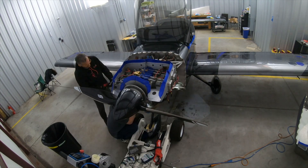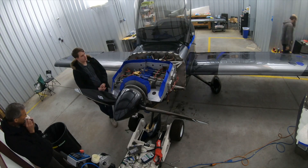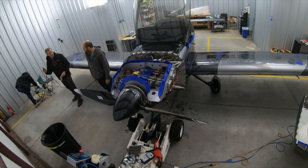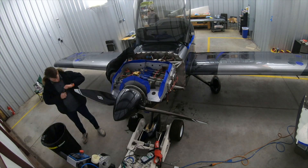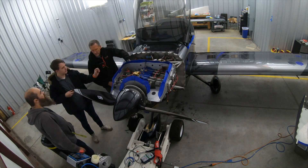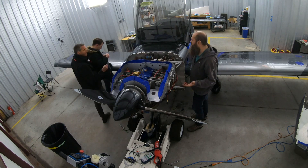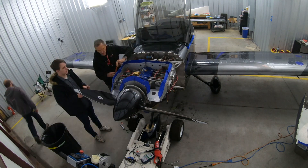The top was just really undoing the worm clamps and pulling them off. We wanted to make sure to get that done before starting on the other side. Then we took the opportunity, as we were going to split it into two days, to glue on the pads on the bottom and install the heating elements inside the cylinders on that first day. That way, everything got a chance to cure and stick into place so we weren't worried about anything moving on day two.